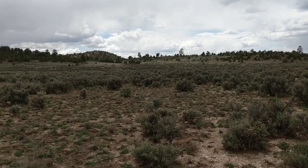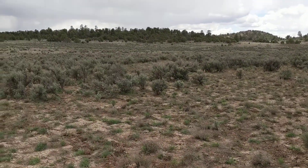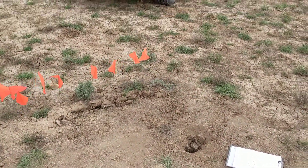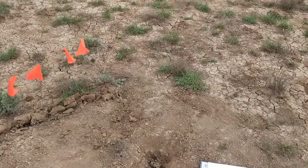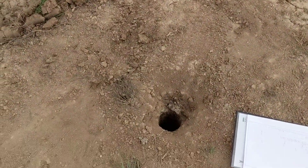So we wanted to put one right where there's a differentiation between two soil types — the gravelly loam and then a clay. We wanted to see if indeed it was clay. So because we're so close to the other soil profile, I bored a hole 12 feet deep.